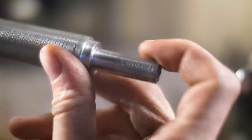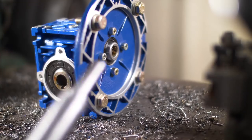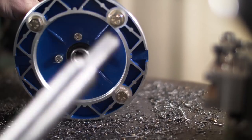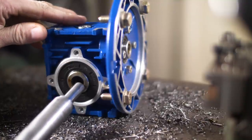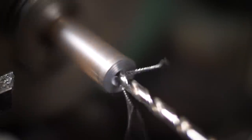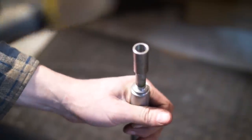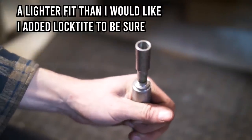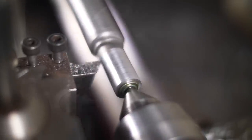I have made a mistake though - the diameter of this end piece. This shaft needs to fit into this reduction gearbox. When I measured this, I measured the input. I should have been measuring the output. So we're going to have to bush this. With the bush installed, I put the shaft between centres again and turned it down to the final diameter.